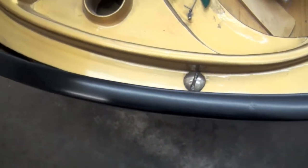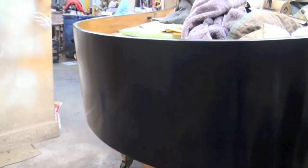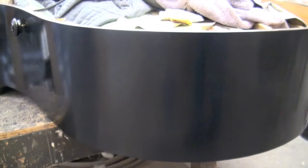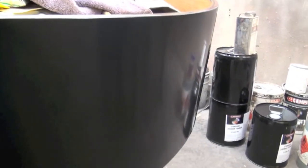On the outside, we put one coat of straight black after the primer, sanded it down, then put a second coat of black, and for the final coat used black plus clear. It comes out looking exactly like the rest of the piano — a little smoother than the original since that wasn't a brand-new finish. We sprayed it out to the breaking points of the apex of the curve on each side so you won't detect where we started and stopped, and we compounded it out to feather it in. When it's all finished, you've got basically a piano that doesn't look like it was ever damaged.